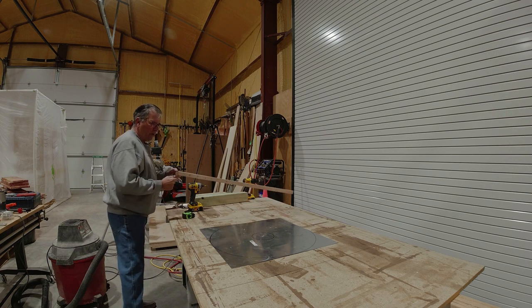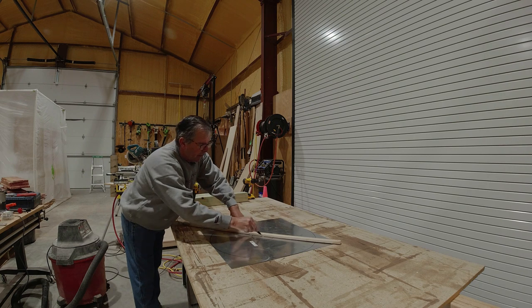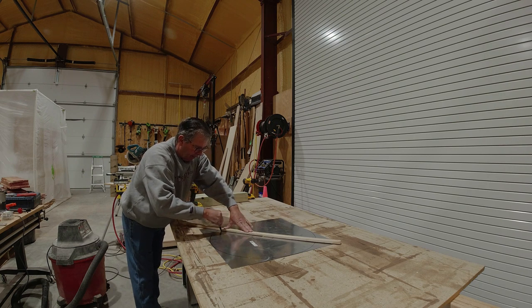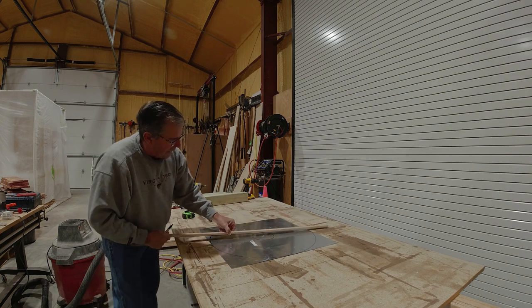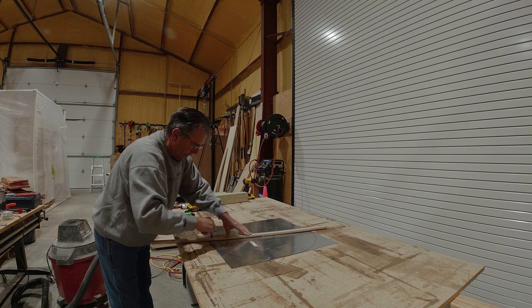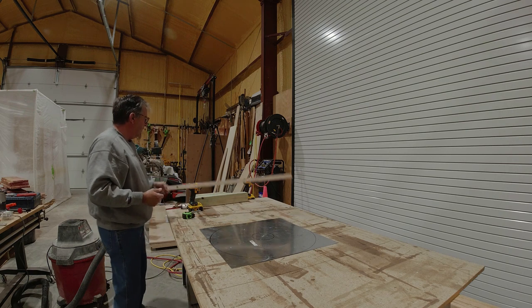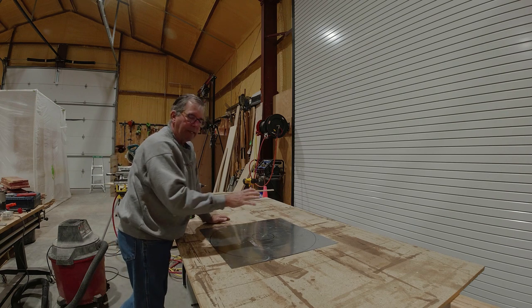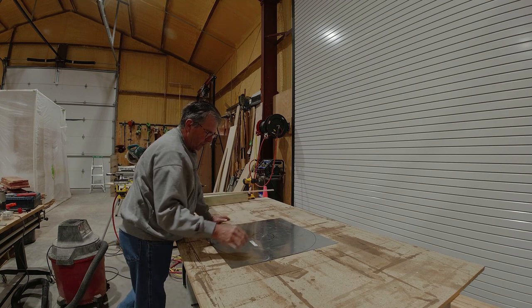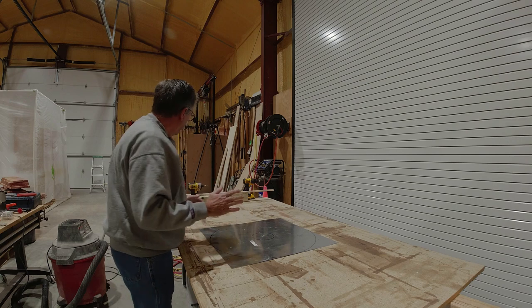These are not hard to make. The hardest part is having a good pair of tin snips. The other hard part, through trial and error, is creating the cone itself. Right now I just have a rough 8-inch opening. You don't want to cut the circle out at this point because you've got to have something to mount onto the post. Think about it — here's a piece of 4x4 and you want something to be able to screw into the post. If I cut the circle out it's just going to fall over, plus you want to keep snakes and anything else from going behind it.